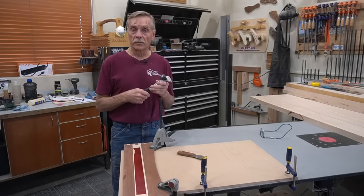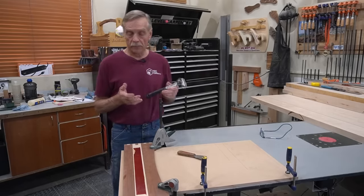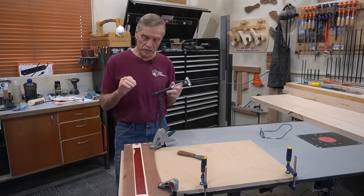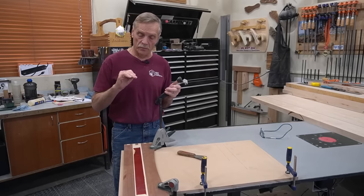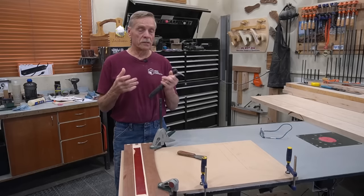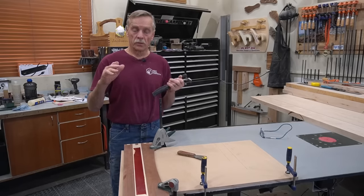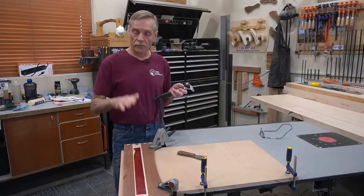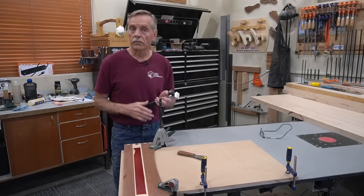And as I've already said numerous times in this video, I hate sanding, which is why I choose this tool. But this tool also really improves the epoxy removal process, because all it does is remove epoxy. It doesn't remove wood. If you start out with 80 grit sandpaper on a random orbit sander, you're bound to remove excess wood on the perimeter of the engraving before you ever get down to the wood over the engraving itself.